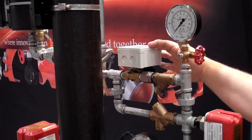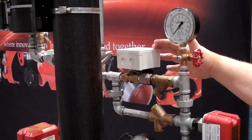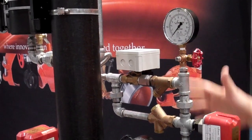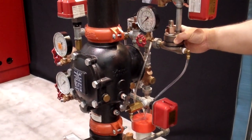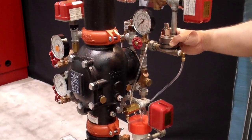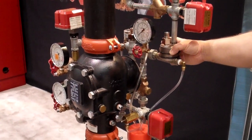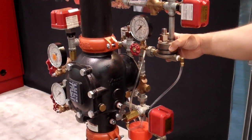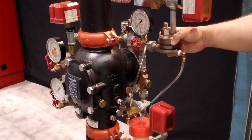However, if you have an extended power outage, this solenoid will open and you'll have an actuator that has an air requirement, so that over time if your battery dies and you no longer have power but there's still a fire, the sprinkler head will cause this valve to open just like a non-interlock or dry valve.